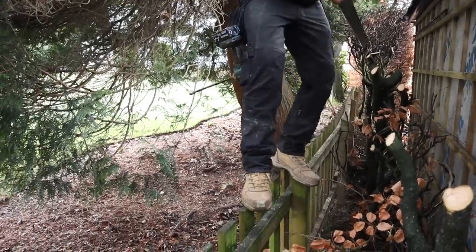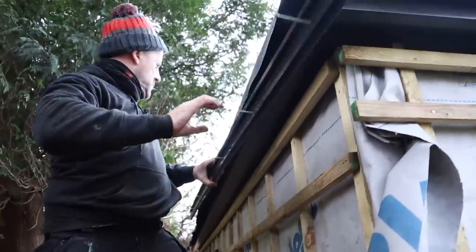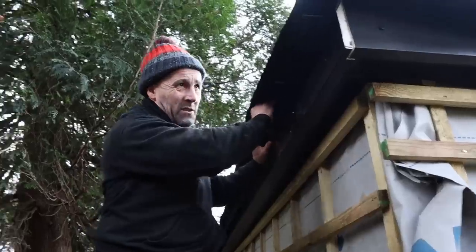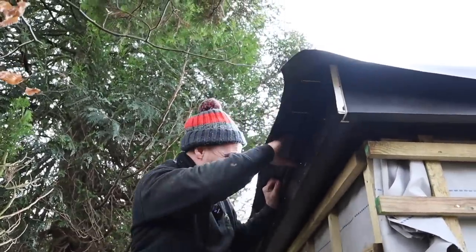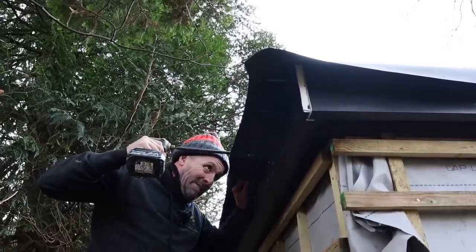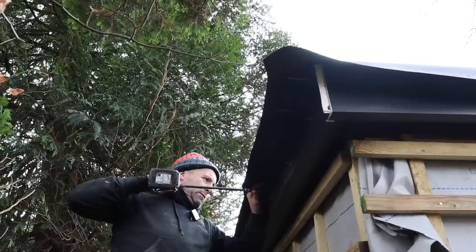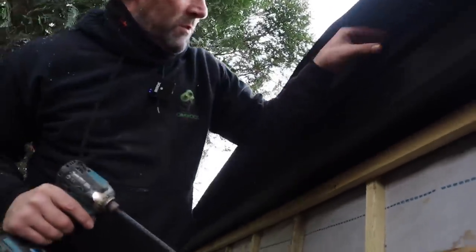As with a lot of these builds, we're often tight for space — everybody wants them pushed back to the boundary. So we're going to put this gutter trim on the fascia there. I've just noticed I've forgotten to put the end caps on — that needs doing as well. I'm screwing it to the fascia, feeling with my fingertips to get it dead flush with the top of the board.